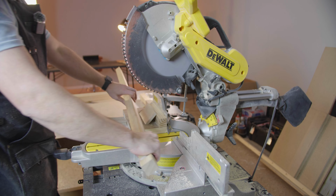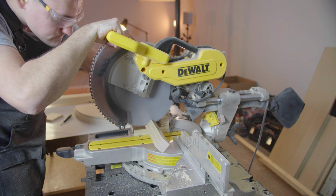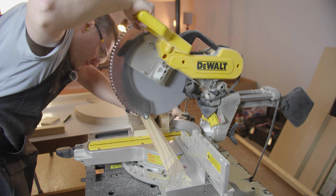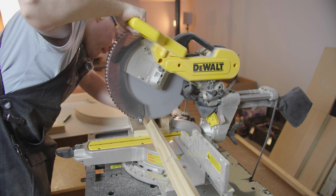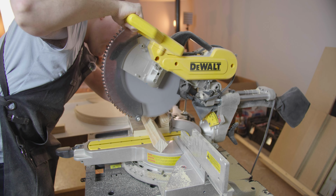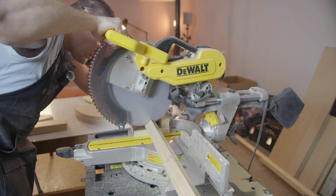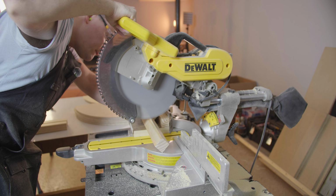fitted nicely. I then moved on to do this 101 more times, which I sped up for you here, but it took a long time. One of the things I did learn while doing this is that it's easier and better to first make your 2 exterior cuts on the dado cut and then take out the interior part after. That helps you be more accurate with your cuts.